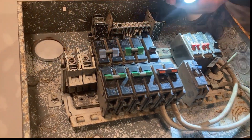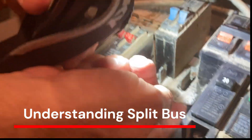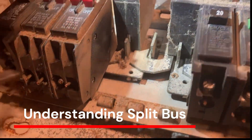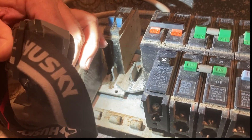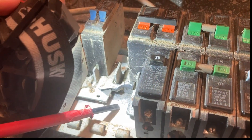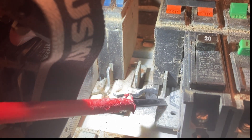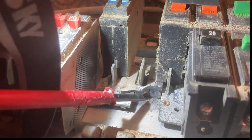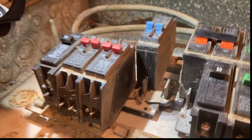If you get in close, you can see the split in the busing. This is an insulator right here. Let's pull this out — it's just black insulator. There we go. Now that's a lot more obvious. You see the busing ends right here for the power; there's a gap, and then the bus starts right here for everything below. That's why it was called split bus.